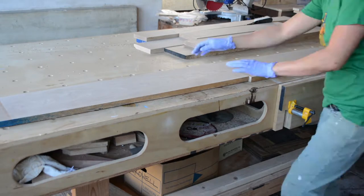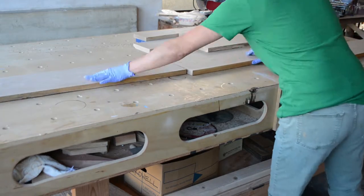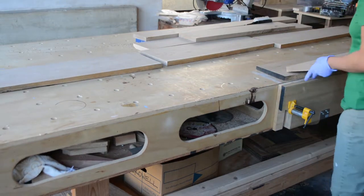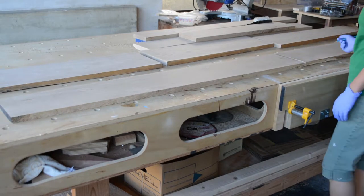Here I'm taking a moment to match up which pieces originally belong together because I'm planning to make each shelf from the same piece of wood. Ideally I'd like to keep the grain pattern consistent and make it look like one piece of wood wrapped into a hexagonal shape, but I know it'll be difficult because I'm losing a few inches in the middle due to planer snipe.